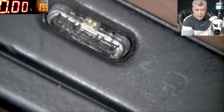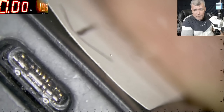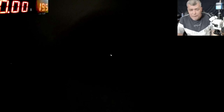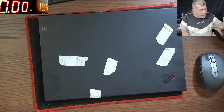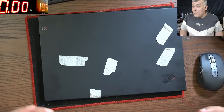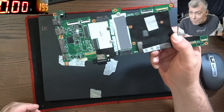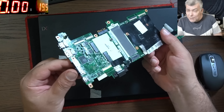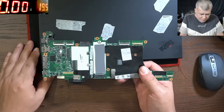You can see the pins are broken inside, here and here. So we have to replace this charging port. I tried to explain to the customer — let me first see what charging port is there, let me order it — but the customer said no, I will send you a spare board so you can take the charging port from it to replace it, which is very nice.